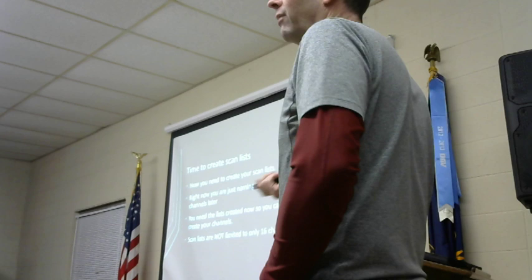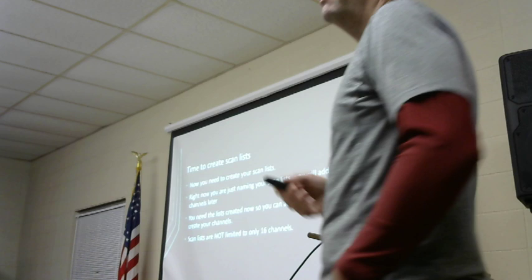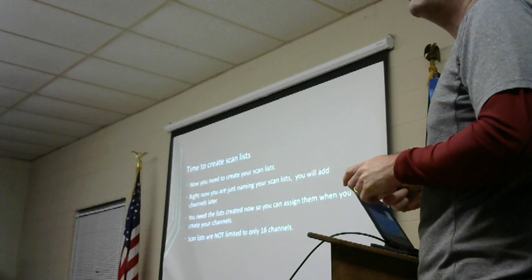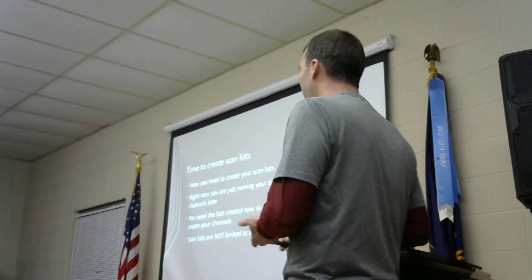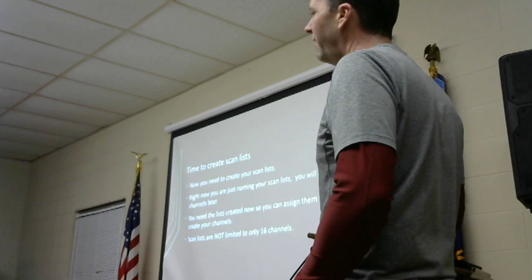Now, if you're scanning between different repeaters, like between Ozark and your local repeater here, then you might want to scan because there could be different things. Then you can scan and be in monitor mode, and you can be really confused: what talk group was it on? What repeater was it on? Since you haven't created any channels yet, you're just creating a scan list, because when you make your channels, you have to assign them to a scan list. So it's easier to have those created beforehand.